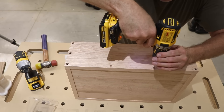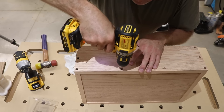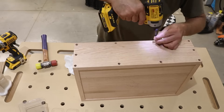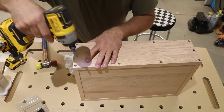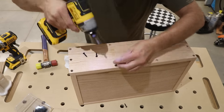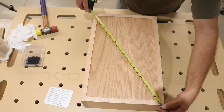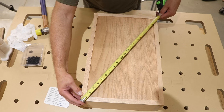I go ahead and drill pilot holes where the screws will go — the Forstner bit will dimple the center of that hole and help you locate exactly where to drill. Then go ahead and run screws into those holes. I don't torque it down real tight, I just cinch it up snug, and as I do this the box gets really strong and sturdy. I go ahead and check the box for square — mostly for kicks at this point because if it were out of square there wouldn't be anything I could do about it. But it turned out to be right on.